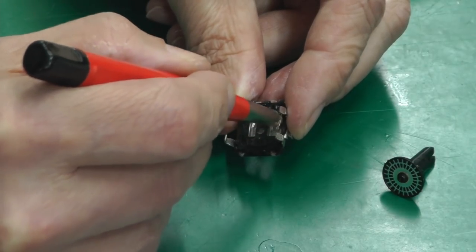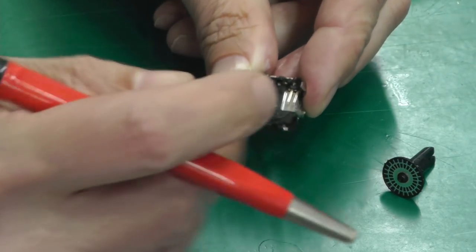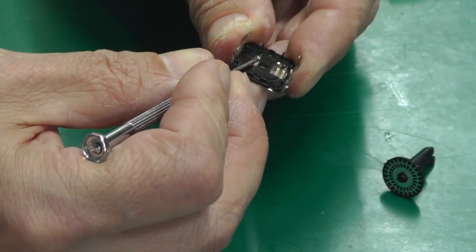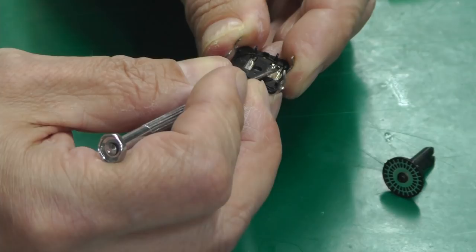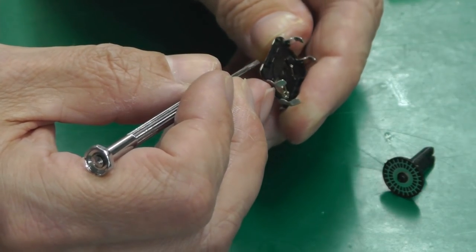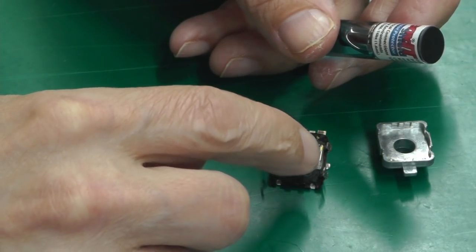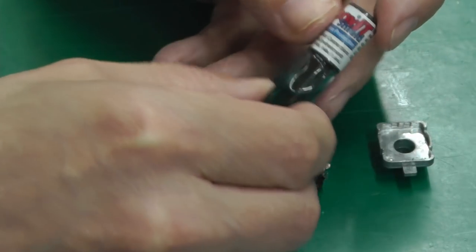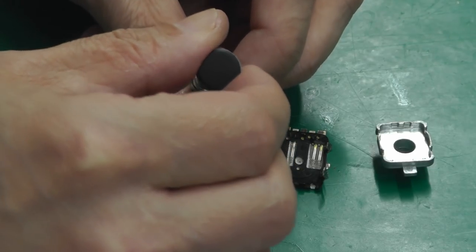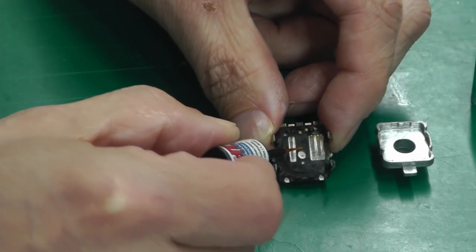Got to be very delicate with these because they are very small. That should be enough. And then I will just bend them up very, very slightly. Now before I reassemble it, I'm actually going to put some contact lubricant on the contacts themselves, and I'm going to use some of this DeoxIT Shield. This is a handy little applicator. It's almost a tiny little brush, as you can see, and I'll just put a little drop